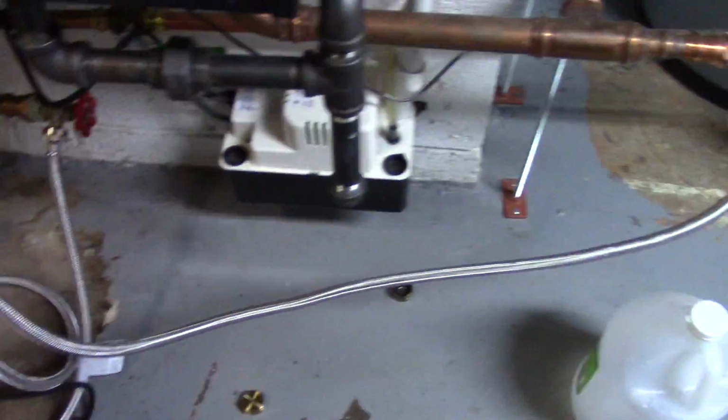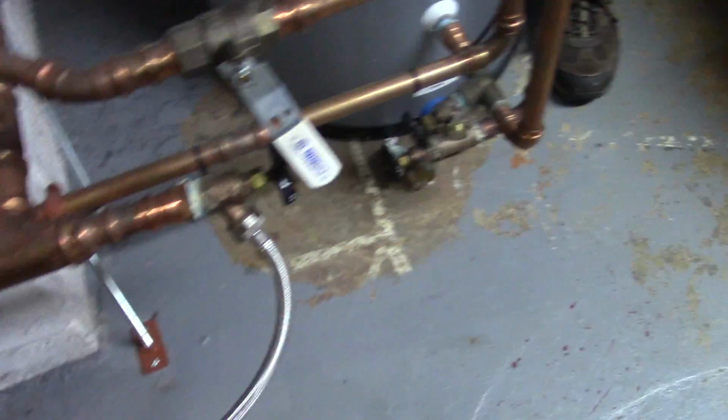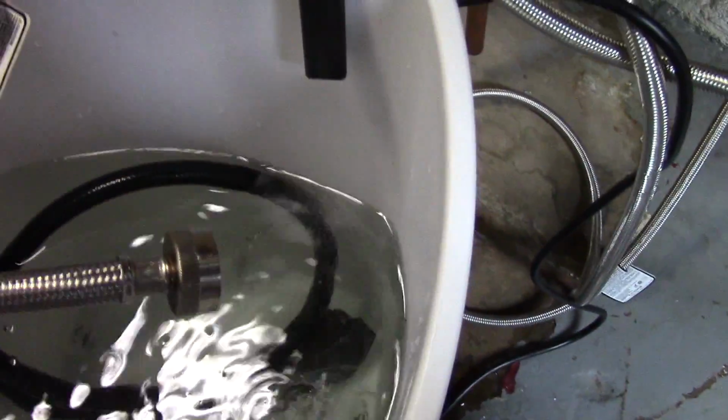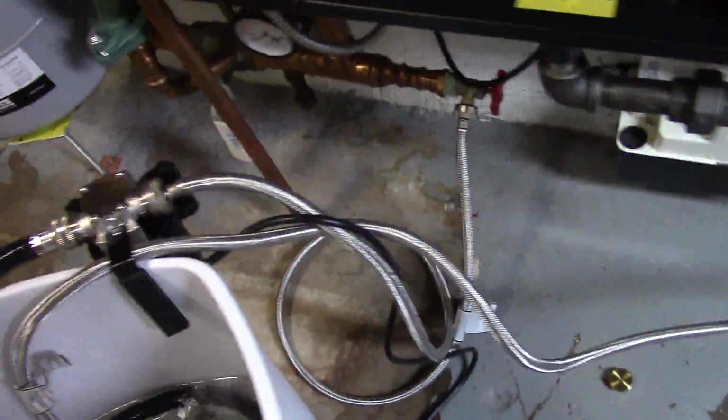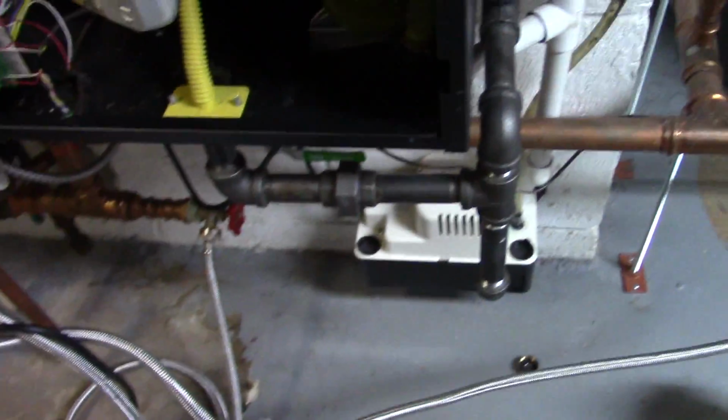And I ended up having to reprime the pump. To do that, I took this hose and hooked that up. I hooked the hose from here up to my water hose, and went through that way. And then right after I disconnected, I hooked everything back up, and it ran. The pump primed a lot easier.